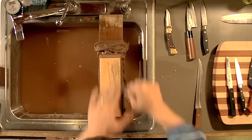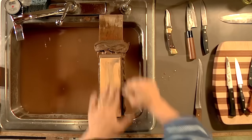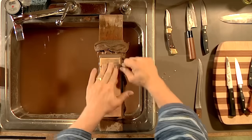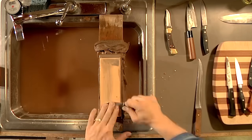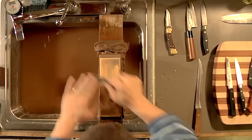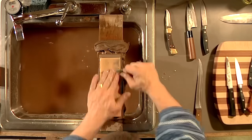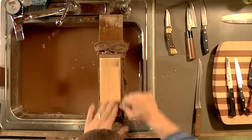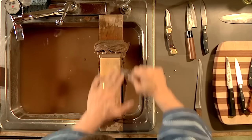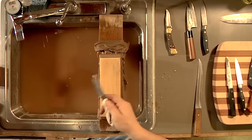This looks so pretty, guys, when you polish up the secondary edge on a fine finishing stone like this 6000 grit king stone that we sell. And being careful to keep all the scratches in the same direction. I'm not going this way and then this way and then this way. I'm just going backwards and forwards. I'm almost done. See, that just takes no time at all. Yeah, look at that. That is so attractive.